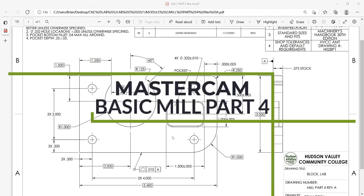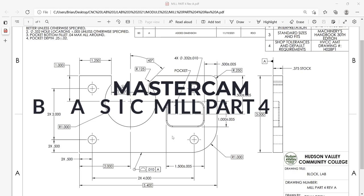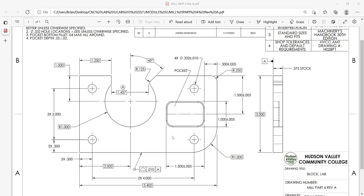This is the part we're going to be programming for this example. We'll draw it right from scratch in Mastercam — we will not be importing it. We're going to use a set of soft jaws to machine this, working with half-inch by six aluminum stock. We'll step a set of soft jaws mainly to keep students away from hard jaws in an academic environment. It'll be safer for tooling. The step is around a hundred thousandths, giving plenty of room to work around the workpiece, then flip and face the backside — two ops, three if you include making the soft jaws.